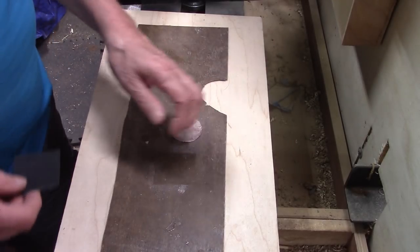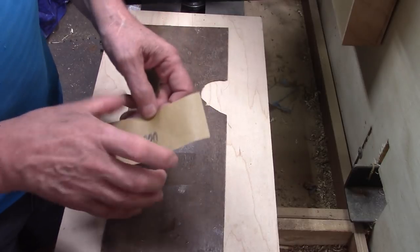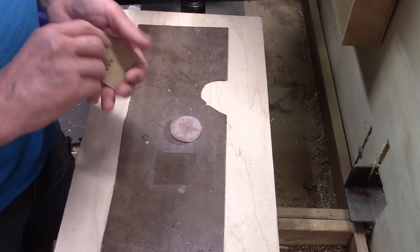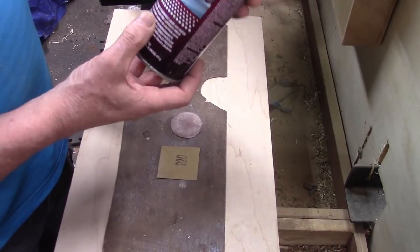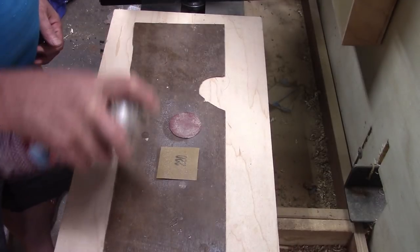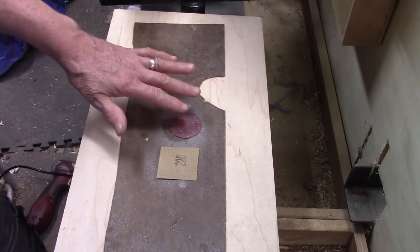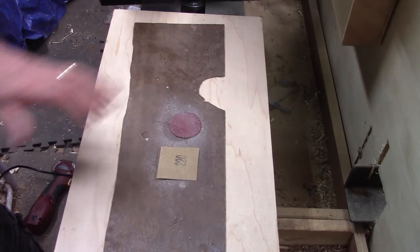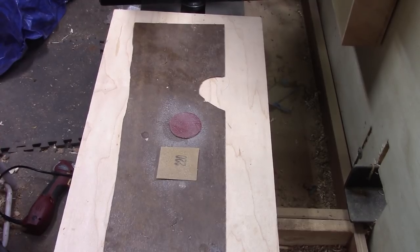That's definitely worn out but I'm going to give it a new face. I've already cut this to the right width — it's a 220-grit. It's really good sandpaper, very inexpensive. I buy it at Harbor Freight. I'm going to lay this down here. I have a spray adhesive and I'm going to coat both areas, concentrating on making sure that the worn-out sanding disc gets a good coat. The reason for that is it's not as flat and smooth as the sandpaper, so you want to make sure you get enough on there. We're going to let that tack up like you would an adhesive and I'll come back and show you how I put it together.